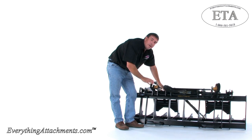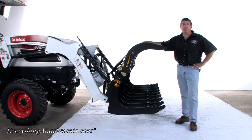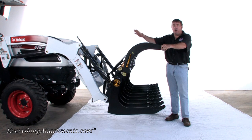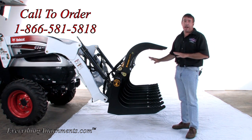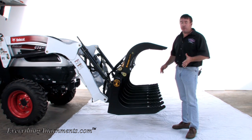You can get four-pin mounts for most loaders — there is a small upcharge for that. Just let us know what you've got so we can get you the right mount. If you're considering purchasing a Construction Attachments root grapple or brush grapple for your tractor, there are a couple of extra things to know. You're going to need hydraulics to open and close the clamshells. On this new design, it has a 29 and a half inch opening, so you can get to just about anything this size of tractor is going to handle. This compact root grapple is meant for 50 horsepower and below, and it comes in 60, 66, and 72 inch widths.